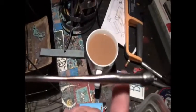But now I want to show you something else. If you look at the thickness of this, and then you go up to here and look at how it tapers to a way thicker part down here by the threading — the thickness here is thinner than the thickness here, so the blade is thinner than the threaded rod. I believe, if you can see the coloration here, this is a heat-affected zone of a weld that they have sanded right off.